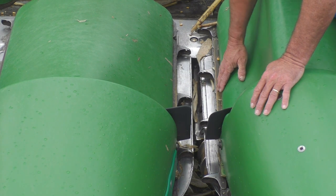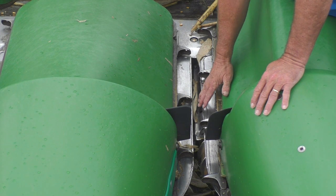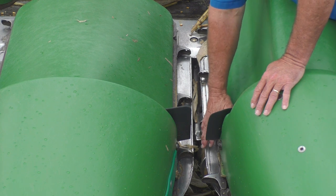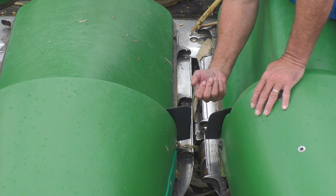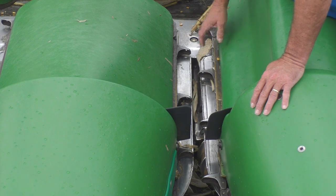The other last thing you can do is tip the deck plates down a little bit. Tip your head just a little so the front end of the deck plate is lower than it normally runs. That'll help grab that corn closer to the ground and bring it up.